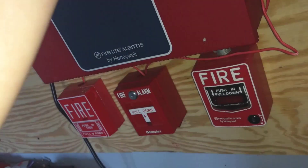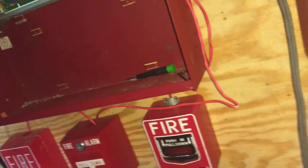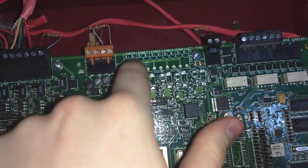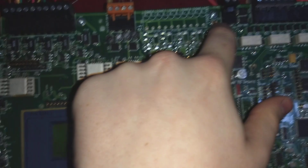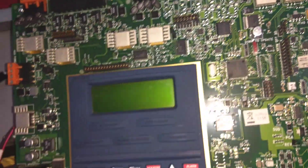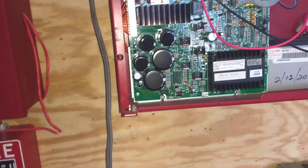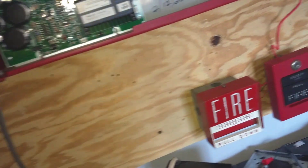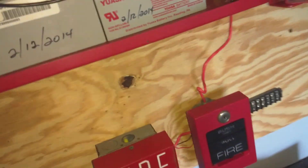Kind of like how the 5UD has room for the extra zones. Like if you look into the 5UD, the only difference between keeping it a 10UD and a 5UD is the fact that it doesn't get filtered power. They design these panels the same way, but they just don't solder on a terminal block to decipher whether or not it'd be a 10UD or a 5UD. And there are 5UDs that do filtered power, and there are 10UDs that do FWR, but the more common 5UD model does FWR, and the more common 10UD model does DC. But enough about that panel.